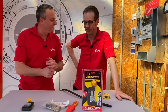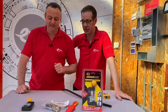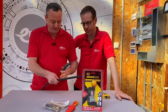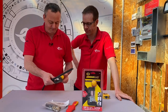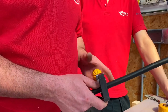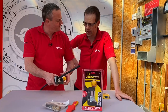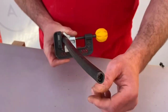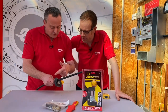We've had plenty of races where I've taken you on with the traditional tool versus the newer tech. I love all the newer tech — it's really interesting to see new things. So you're going to wow me with the CK Armor Slice. We'll take an approximate length there — it doesn't matter what we're terminating, it's a technique. We wind her open and slide her on down to there, and then according to the instructions we clamp it up. It does it from, I think, 12mm to 36mm diameter — so there's no 12mm conductors or 36mm square cable.